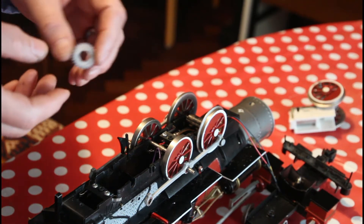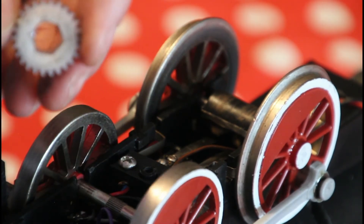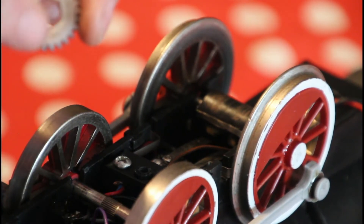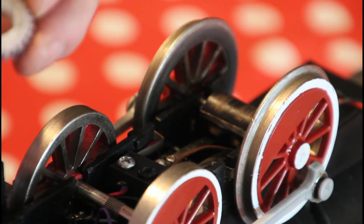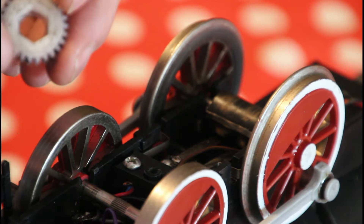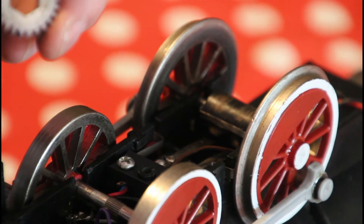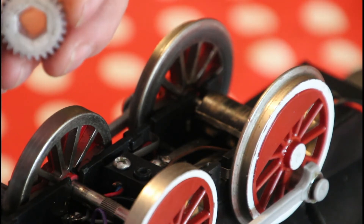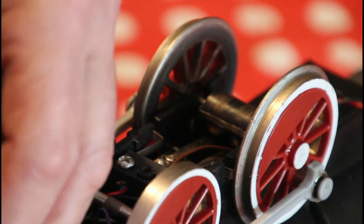The answer was to 3D print another gear. This one's got a big hex hole in it because I put the hex in there and then got a piece of brass hex — three-eighths of an inch. I drilled a six-millimeter hole in it and pressed that little brass piece onto the rear axle. This then pushed onto it, giving a nice firm fit without putting the plastic under stress, and it's held in place once assembled.